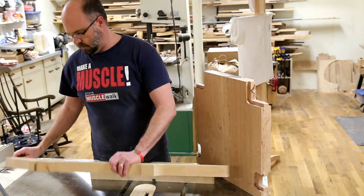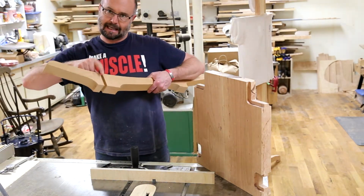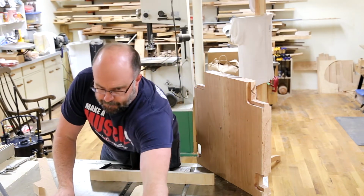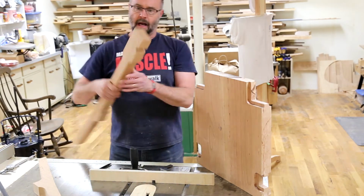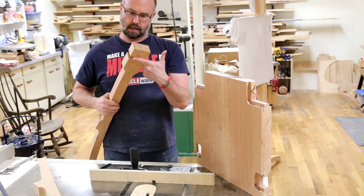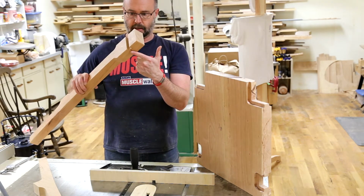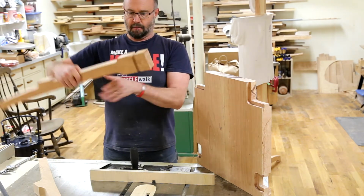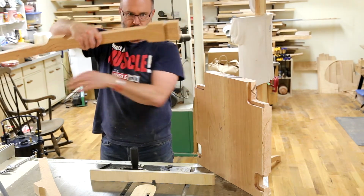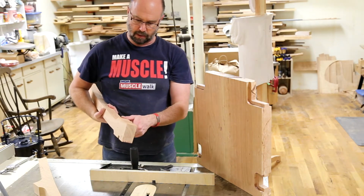Okay, so now I've made the first two cuts on the fronts and the insides of the back legs. On the front legs, let me grab one. I've made two cuts. One is on the front face, which is the reference face, and then the inside. I wasn't able to cut the sort of back side of the front legs because this reference surface I can't set up on that saw because of the curve over here. So this I'm going to probably do either with a router by hand. I haven't decided yet. We'll get to that a little bit later.